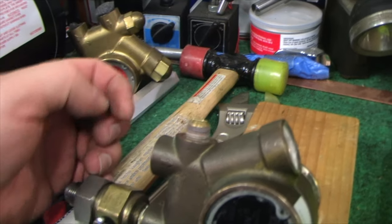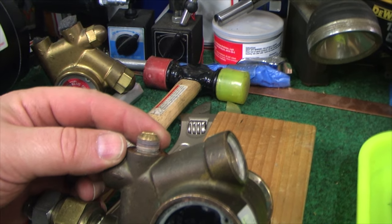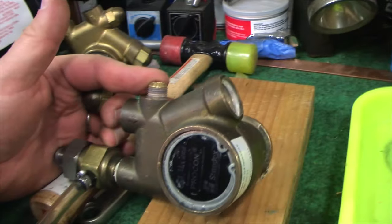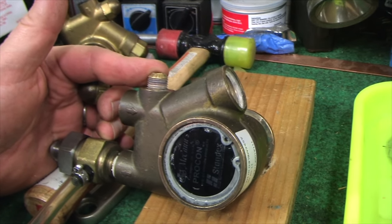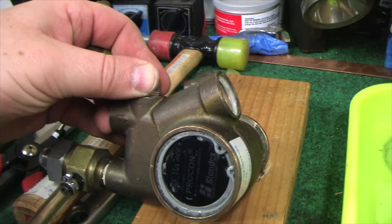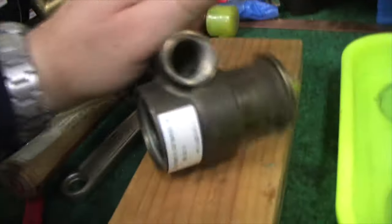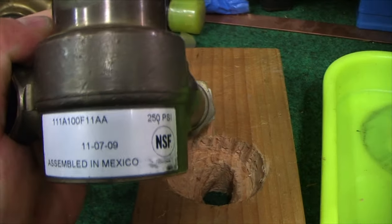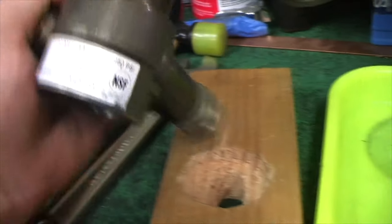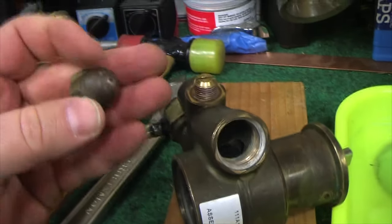This other fitting is basically the pressure regulator cover — really a blowoff valve internally that keeps pressure from overbuilding. The McCann's default carbonator pumps all come with, I think, 250 PSI bypass as set. It'll usually say on the pump somewhere — you'll see the part numbers and at the end '250 PSI.'